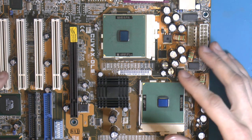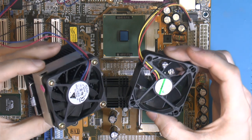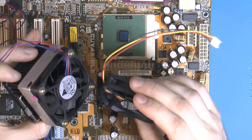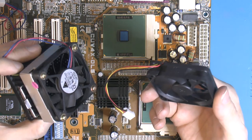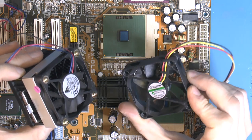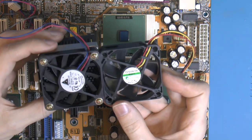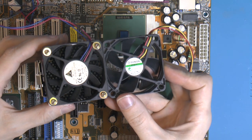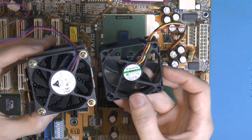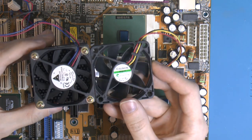So now before we mount the coolers and RAM, I need to swap some fans on these heat sinks here because of noise level and one of them having a bad bearing. So with the fans I found two slightly thicker but lower RPM Sunons, which is a really nice brand. And you find them in old computers too, so it's perfectly suitable. You can actually see here how small the motor hub is on these things. I use one of these, but the 10mm thickness one, in an ITX router. It's really nice to be able to have these small motors. Gives more surface area for blade.